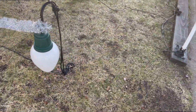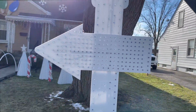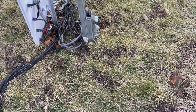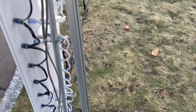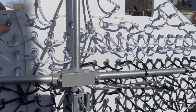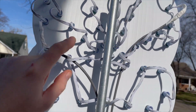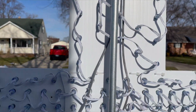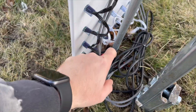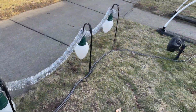As we move over to the other side we have our North Pole sign, which we used as a matrix and a tune-to sign. This allowed us to tell viewers which radio station we're using, and it's mounted with super strut material — the same we use for our spooky tree at Halloween — in addition to half-inch metal conduit (EMT) normally used for electrical wiring. Right here we have a few different power injection points. When you run pixels in a high-density prop you'll need to inject voltage, because as voltage travels through the pixels it decreases and the color will change. These weatherproof connectors for power injection keep the prop a consistent, uniform color.